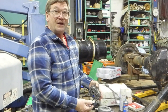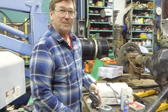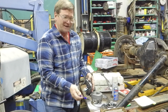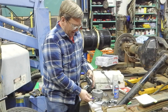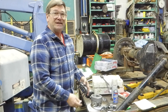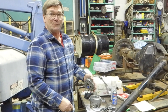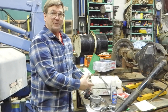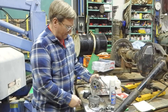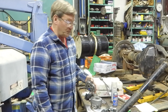Why do we have to turn it slower? Because of its maximum RPM. This pump is probably a 3,000 RPM pump originally, but that's figured on 15 psi being able to suck in enough oil of normal viscosity through this port without cavitating and ruining the pump. If you make too much restriction on the intake of a hydraulic pump, it will ruin the pump — even if we're not asking it to do anything strange on the output. It will ruin the pump because it can't suck enough lubrication through to cool it.